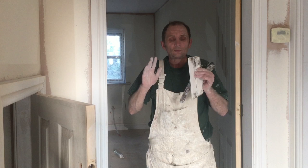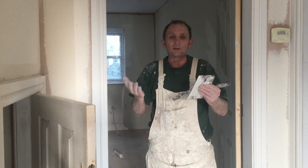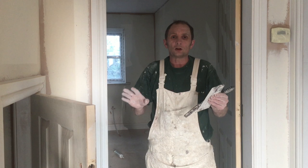get everywhere wet filled, which is mix your filler up and get all your woodwork, frames, skirting boards, door edges, the lot. First thing you do, fill up. Next thing you want to be doing is gun filling all your frames, down your architraves, above your skirtings, etc. That's the next thing you want to be doing.